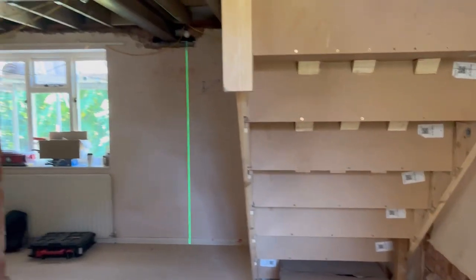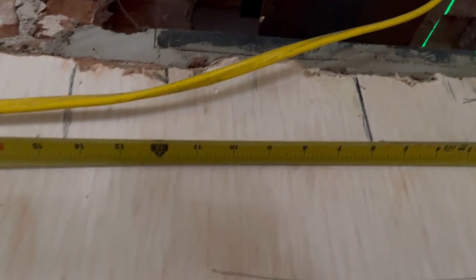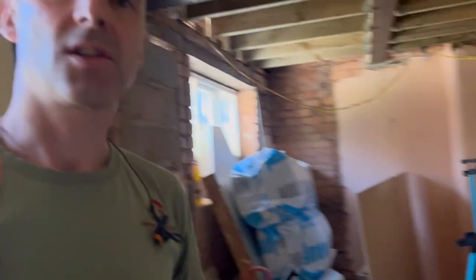What I'm doing now is using the 72 we've got left — I'm going to construct a wall here with 6x2 on the steel first. Then we're going to have roughly a 300mm wall there. I'll fix the 6x2 on the steel first to give me somewhere to fix to, then start studding off that. We're going to use the old ceiling rafters — very good timber, pitch pine I believe — to build out and pack out to the face of the other side of the steel to get our 300mm wall. Then I'll show you the setting out, where all the rooms are going to be, doorways, etc.